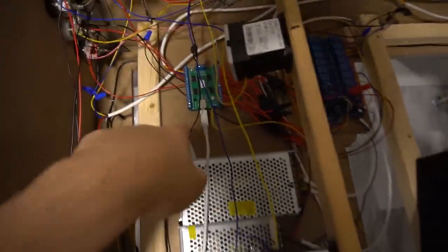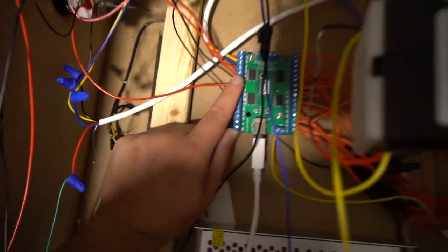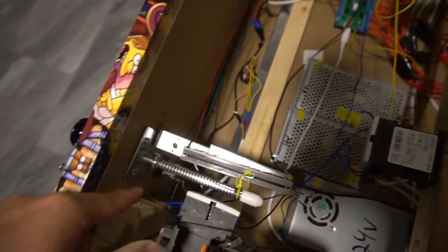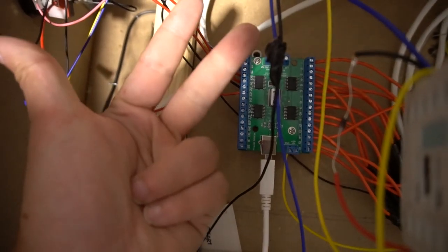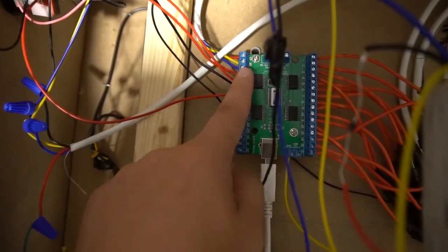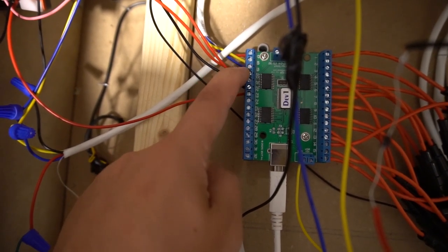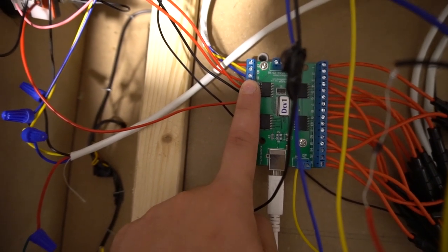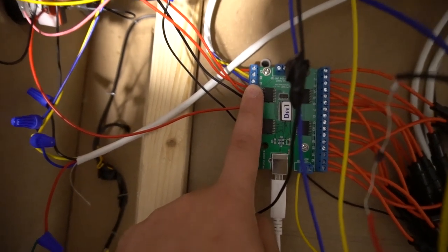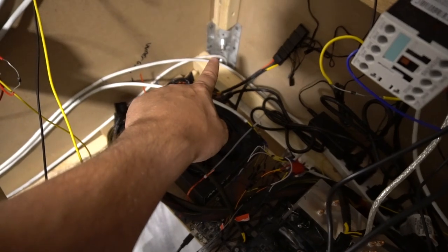The last things real quickly now, on the left side of the LED blinky are all of my button lights. This side right here, we have RGB LED strip. That means that there are literally three inputs, RGB. You literally need three inputs on the LED blinky to make the RGB work. Literally this pack right here is going to my LED strip that starts there.